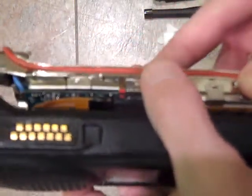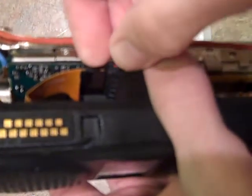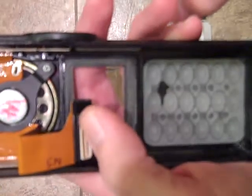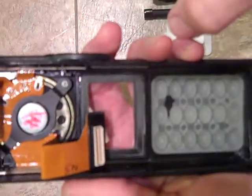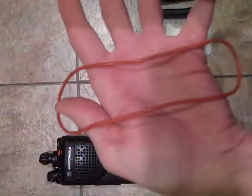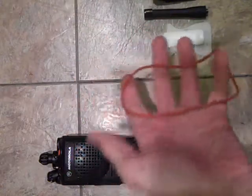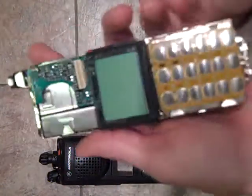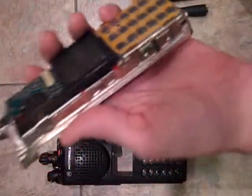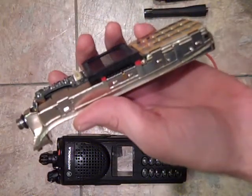and you'll notice you've got a flex connector in here. Motorola makes an A and a B. You can take this flex connector off by flipping the connector. It's got a place where you can do that. Now, the O-ring is intact. There's no damage to the O-ring because we used the handy dandy little Motorola tool. Okay, so now what we've got is the basic radio skeleton.